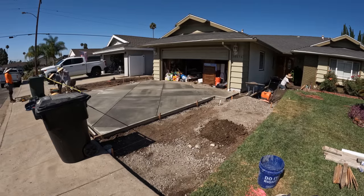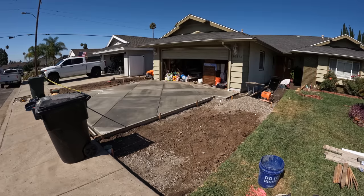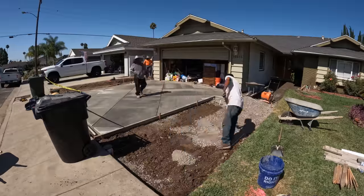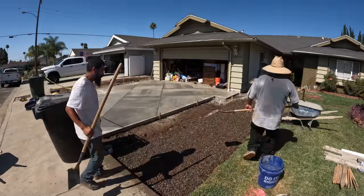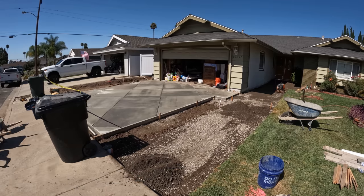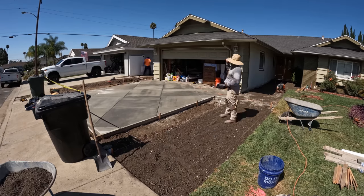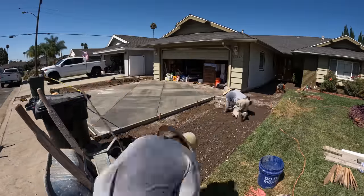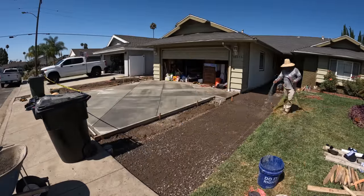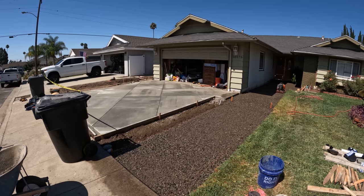You can also see the driveway was poured out, so that would be part two, and that will also be in the description. But in this video we're going to be just focusing on getting the pavers installed and showing you all the prep work. So we are compacting the ground a few times before we even bring in more of the base because it was a little deep. We did want to compact and make sure that this surface is really nice and hard so there's no chance of any dipping in the base.